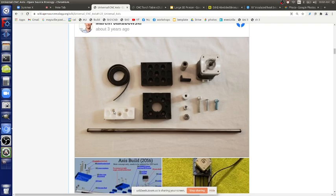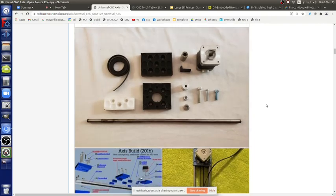For building the structure, I'd suggest mounting the XY gantry at a comfortable height — about six feet. Hanging it above your head isn't comfortable and we can always mount it higher later since the system will be completely remountable. Let's work comfortably so we don't have to go on ladders to mount the axes — prototype at a comfortable level so we can move it around as we're working.